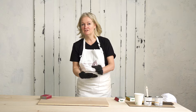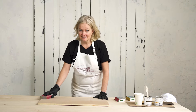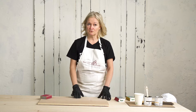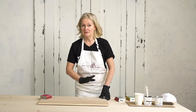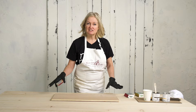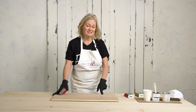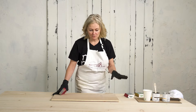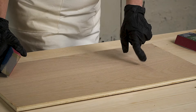When you have a raw wood project and need to prep it for Stain and Finishing Oil, make sure that it is consistently sanded. Always start with a coarse grit around 100–120, then move up to a more fine grit, always sanding with the grain. If it's super rough you could go down to 80 grit, but always go from lower to higher and sand twice at each level. To avoid blotchiness, ensure it is consistently sanded on all areas — I'll demonstrate what it looks like when the stain is applied on an area where sanding was against the grain and too rough.